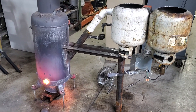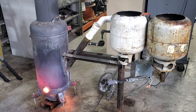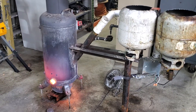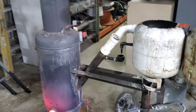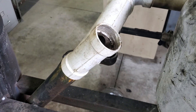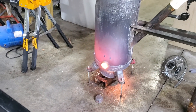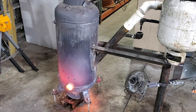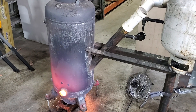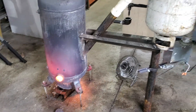You've all been asking me about a diagram on how to put these together. Today it's pretty cold outside so I started this up in my garage. Right now I don't have any air going to it — it's strictly like a rocket stove. It's got oil dripping in it and air is drawn through this tube right here. I've also got a lighting port down here. You can add diesel fuel to your oil, or in this case I just put cardboard in there and lit it through that hole right there, got my oil burning hot.